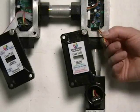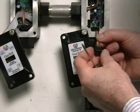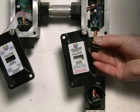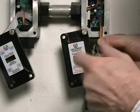The SLAM will require additional wiring for the 3 relays available for alarms. Each relay has a common, normally open, and normally closed connection. Read the manual for more detail on wiring.